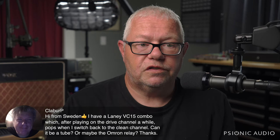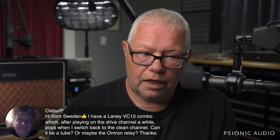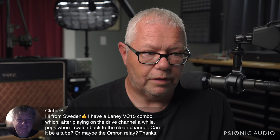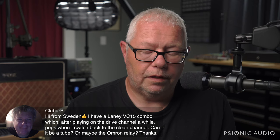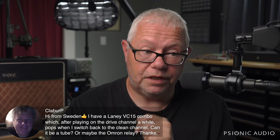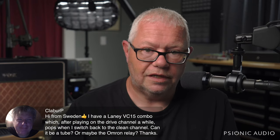Hey, Klaber P. from Sweden. He has a Laney VC15 combo, and after he's playing on the drive channel a while, he switches back to the clean channel and it pops. It's probably not a tube, and it's probably not the relay. It's probably a capacitor in the low voltage power supply, which is what provides the power to the relay. It's also possible that maybe the diode across the Omron coil has failed, or Laney forgot to put a diode across the coil of that relay. It's not built into the Omron. You put a diode across that coil typically to lessen such things.